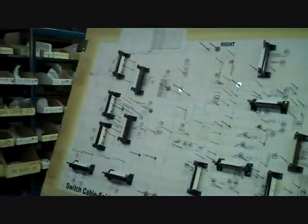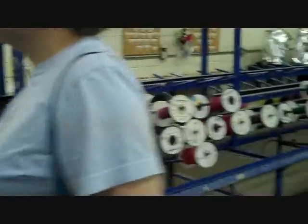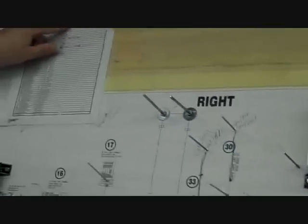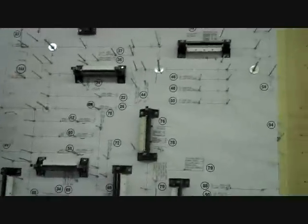1/2 mile of wire in a pinball machine. This layout was created in CAD by our electrical engineer, and what they do is they lay everything out with pins, connectors that go in here, and then they create the run sheet. The run sheet tells them what color wire to pull and for what pins to follow. So they'll follow a pattern along the entire length of the drawing.